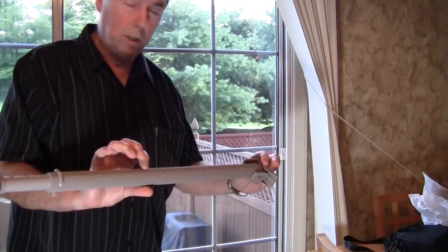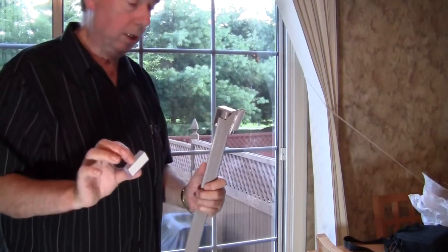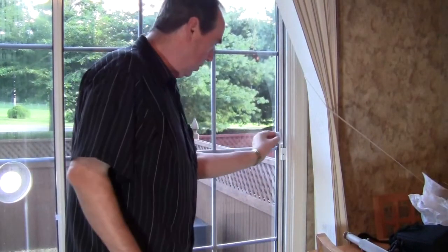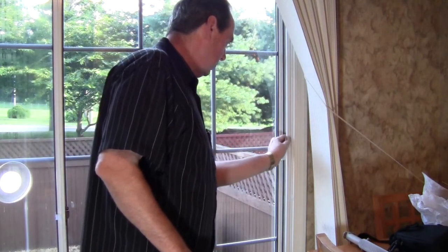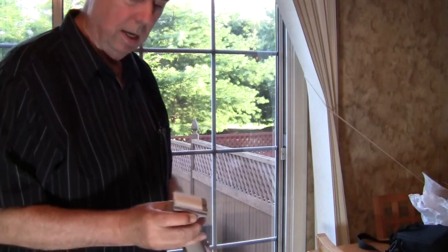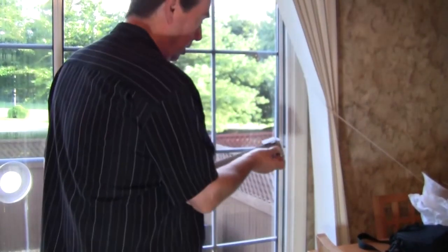This is the Wedget — we're going to install it now in a narrow channel sliding glass patio door. The narrow channel requires the shim kit that's included with the unit. Peel off the pressure-sensitive liner and slide it into the channel where you want the mounting bracket to be located, then press it into place. Install the lock as you would on any other door by removing the pressure-sensitive liner from the Velcro and applying it to the shim you just installed, pressing it into place.